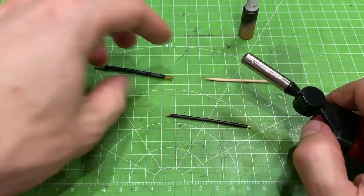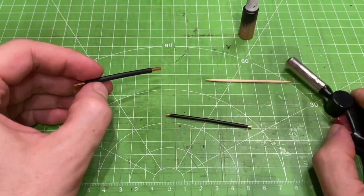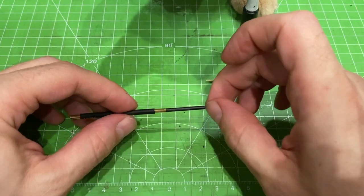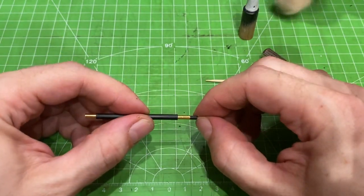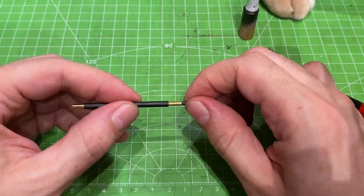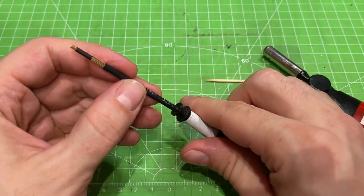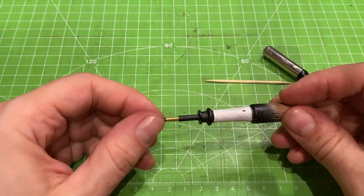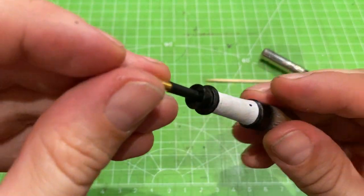So, here the tubes are finished. This is the 3mm one, the thinner 2mm one, and voila, smooth as can be. Very, very smooth. A tiny little bit of friction, of course, but that's okay. The gear motor has enough leverage to deal with that. So, yeah. Once again, here in the 4mm hole, no friction whatsoever. So far, so good. So that should work.